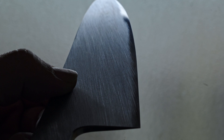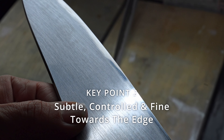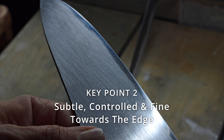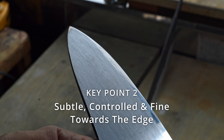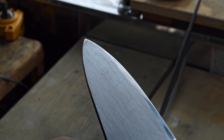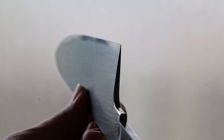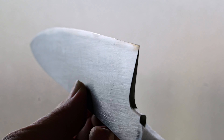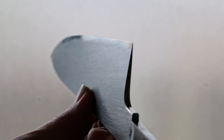The other key thing I feel about grinding the convex is that I don't find there's any real rule on where it should start or what the shape of it should be, but it definitely needs to be very subtle and very controlled, and very fine near to the edge so that when you are cutting — as the description says — there is no drag, no resistance. If it's going from flat to convex, you don't see that transition point; it should be very, very subtle. That's the key thing I take away from this type of grind and what I've personally seen other sharpeners do.